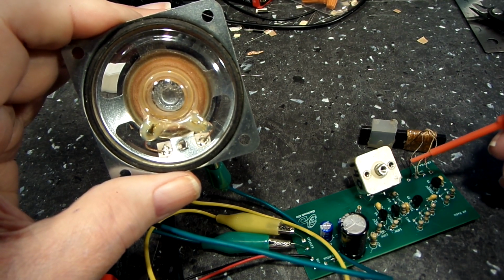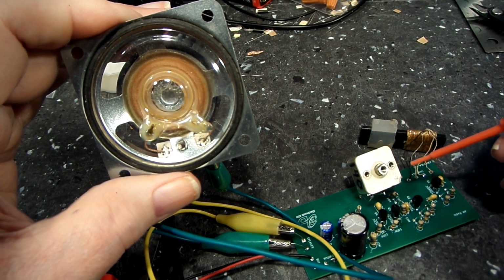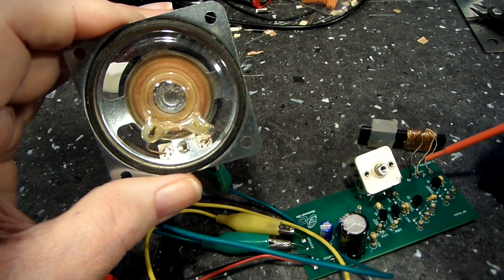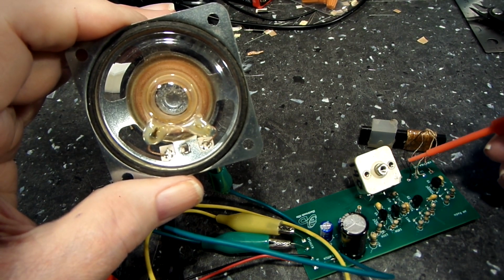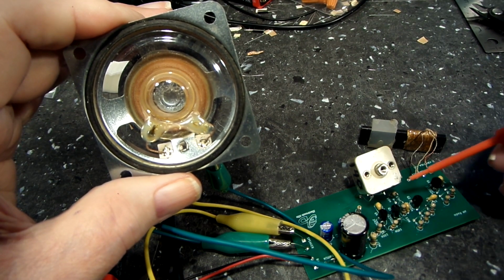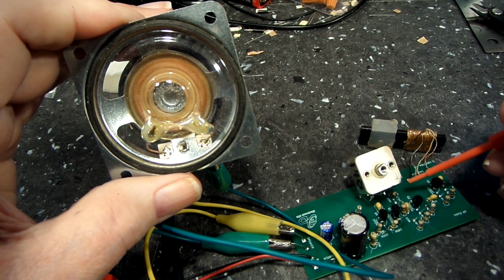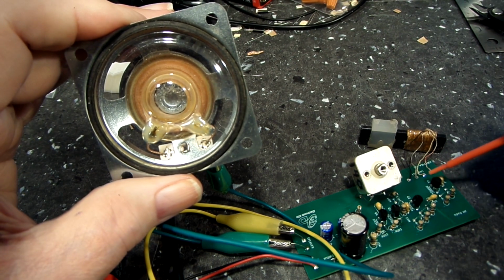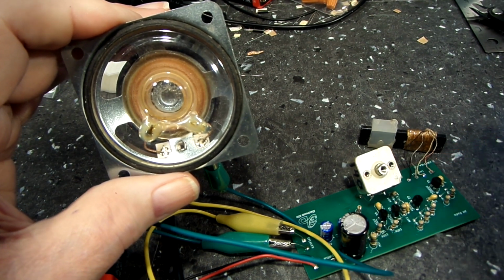But anyway, I thought it would be the two outside ones here, the beige color ones, and then the black and the red maybe. But apparently it's the black, and there's some red tint to this, I believe, and there's black on this one here. So I guess that's the two things. But anyway, these two here on this black one, and this one with the black, is the antenna coil itself, and these are the loop or coupling type section of the loop stick.